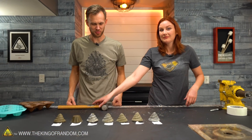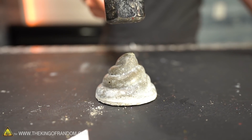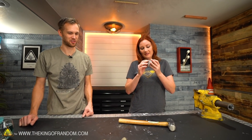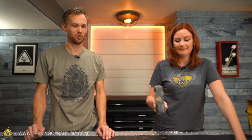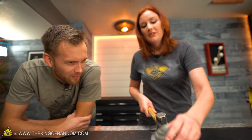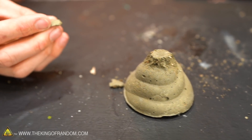Should we see how crunchable they are? Start with small hits. Our extra-strong slow-cure cement seems to be holding up easily — pretty strong with those hammer strikes. We may have to scale that up and take these outside. The one made with sugar has dented the top noticeably with medium hits. The control also dented but less so. We have more dent on the sugar one and you haven't done as strong hits yet. It's breaking off with that medium-strength hit.